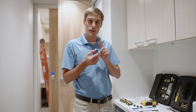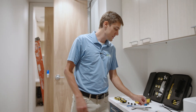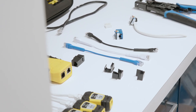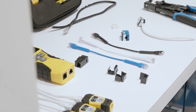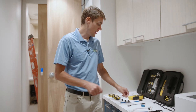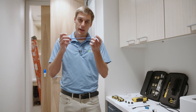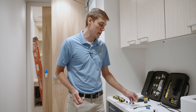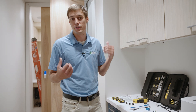On top of using the colored keystones, we also use colored patch cables in our closet. We'll typically use the Ubiquiti six-inch patch cables, and these are multiple colors — you get black, white, and blue. We use those to correspond with what type of connection we're using. So if it's going to be a phone, a data cable, or for cameras, we terminate the cables with keystones corresponding to what they're going to be. It makes it super easy to troubleshoot if you have issues in the future, and it just looks really cool.